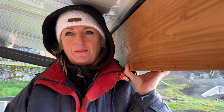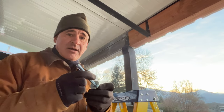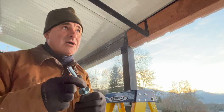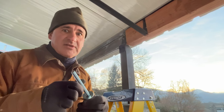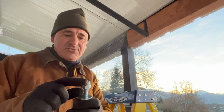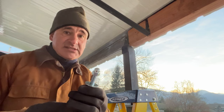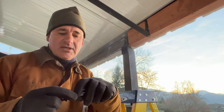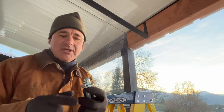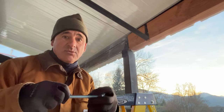I decided to go with a long bar and cut it down, basically because I couldn't find any bolts appropriate for this type of install. So I've cut these down to length, and I'm putting these rounded nuts on the end. A large washer has to cover up any sort of breakout from the drill, but also a nice solid platform against this thin siding wood.